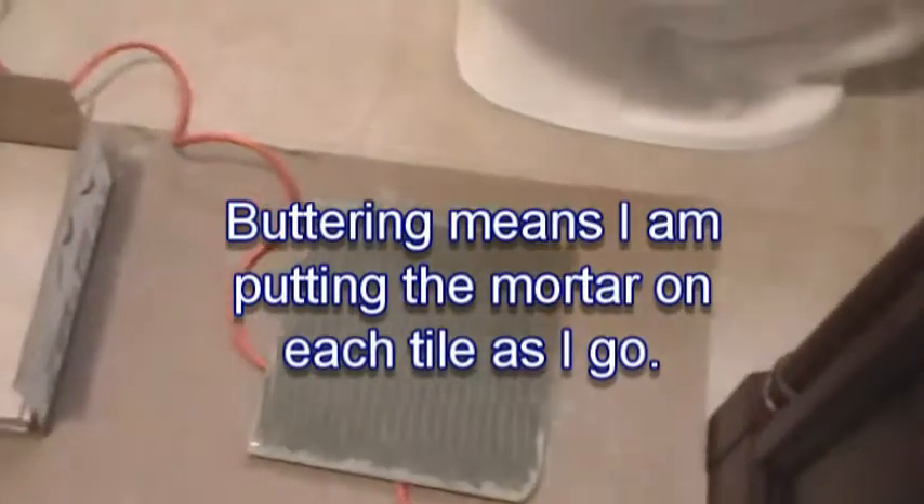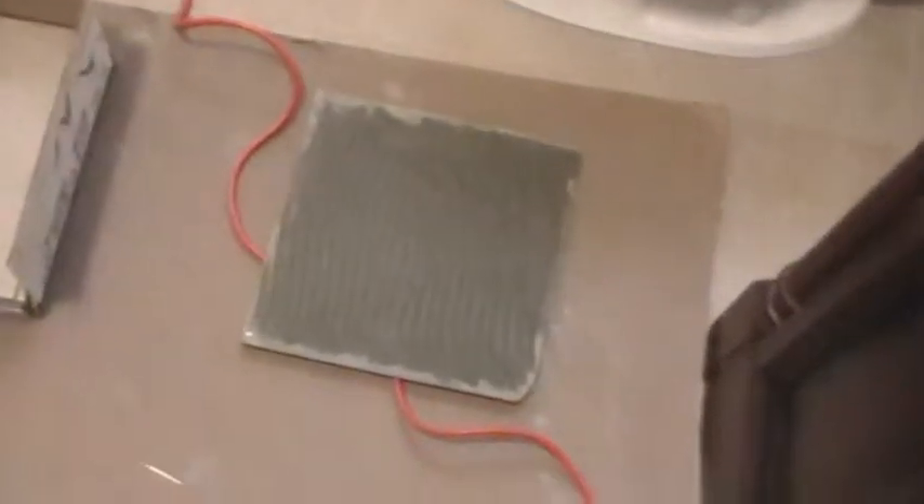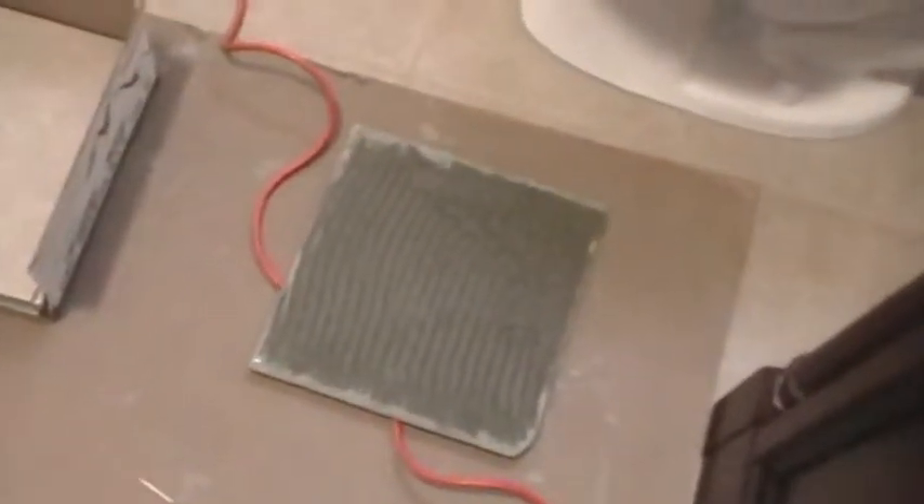I had the border down lower — I was trying to make sure I'd meet up exactly with the ceiling, but the ceiling's not exactly level, so I moved it up a couple of inches. I will have to trim the top row and the bottom row. I've started the installation of the tile on the wall, about three layers. I'm buttering each individual tile. This one I was hoping I could hide a chipped corner in the corner — not so much. Had to pry it off the wall and replace it.